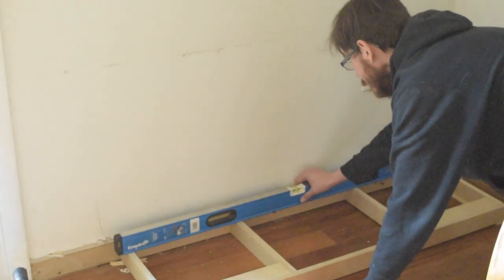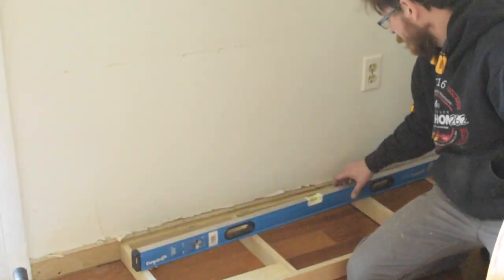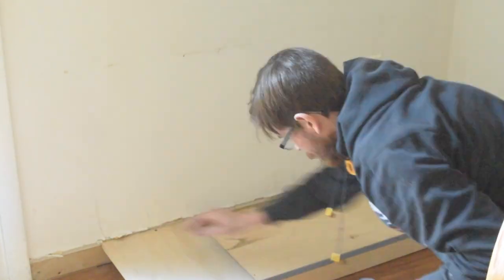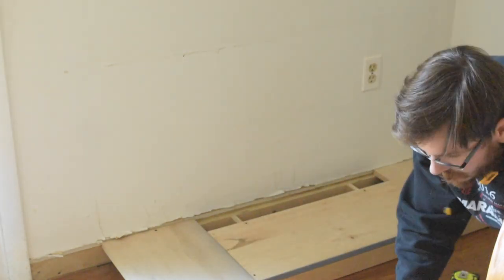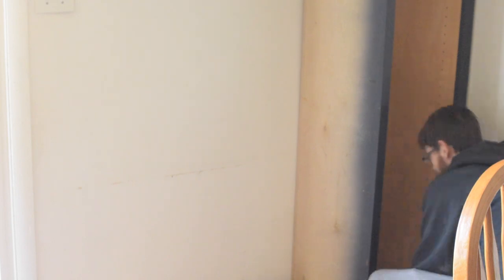I'm going to apologize in advance for the poor camera work trying to film in this small corner of my kitchen. You can see where we start with the separate toe kick ladder piece — we level that, which allows me to set the cabinets in place without having to worry as much about leveling each individual cabinet. We set the large cabinet in place first. There is an outlet back there that I have to cut out of the back — that is the outlet to which I'll be plugging the recessed lighting instead of hardwiring it.